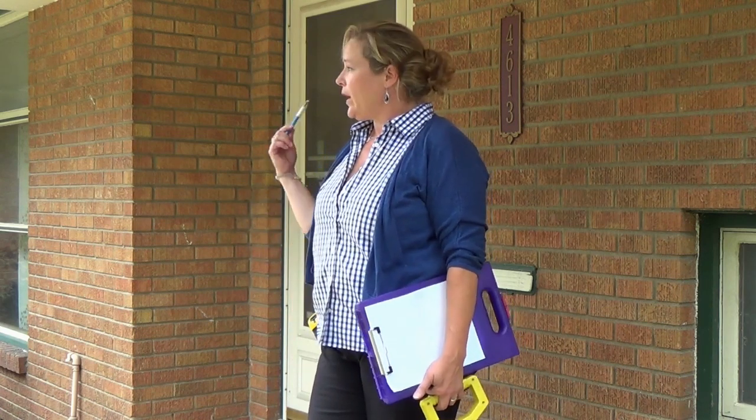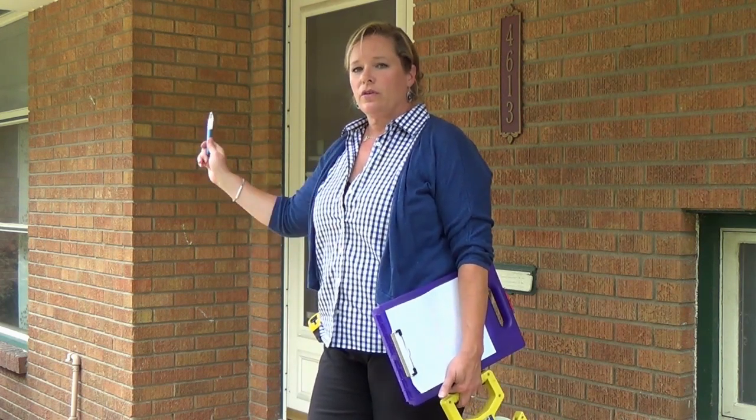So we'll go around the whole house, measure the whole thing, and I'll talk to you a little bit about how to make sure that you've got everything, that you haven't missed anything. There's a porch on this house we need to take into consideration, and also a garage and things like that. So I'm going to start at one corner and start pulling my tape measure across and go all the way around and draw my sketch on my graph paper as I go.